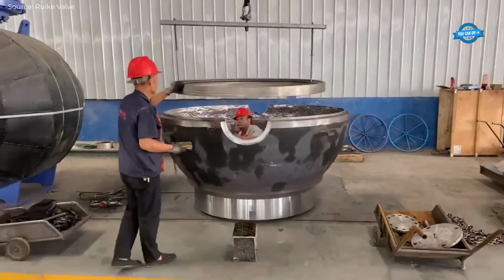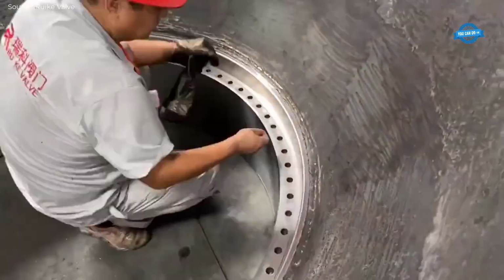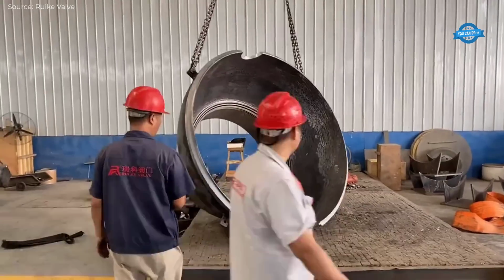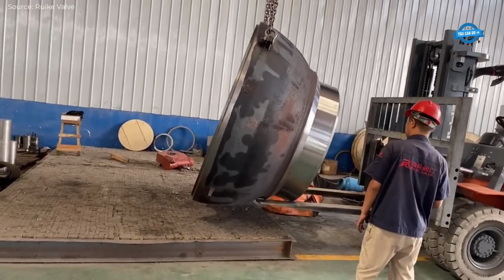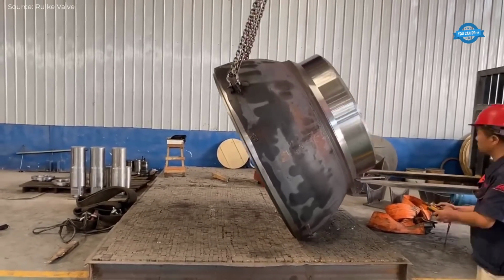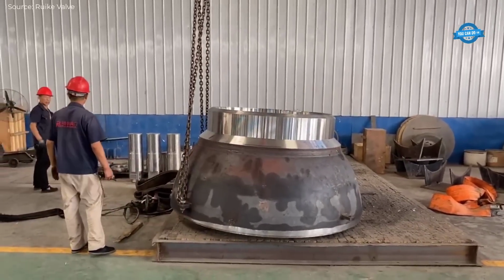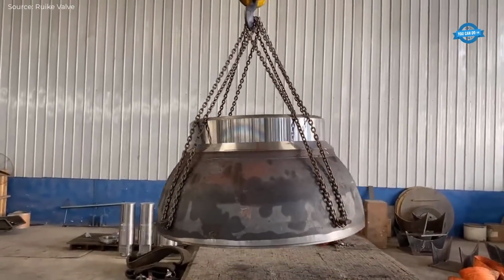The top-mounted eccentric semi-ball valve is designed with an eccentric valve body, ball, and seat, allowing the valve to self-align during operation. As the valve stem rotates, the closing mechanism tightens, ensuring an increasingly secure seal. A key advantage of this valve is the separation of the ball and seat during movement, which eliminates wear on the sealing ring, a common issue with traditional ball valves. The valve seat, protected by non-metallic elastic material embedded in metal, enhances durability.